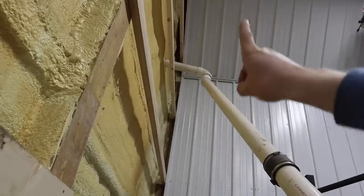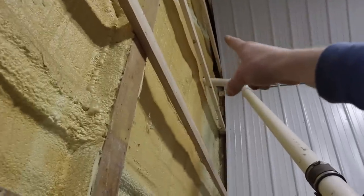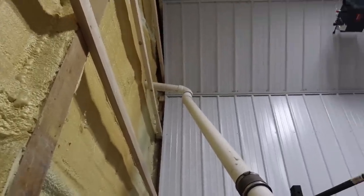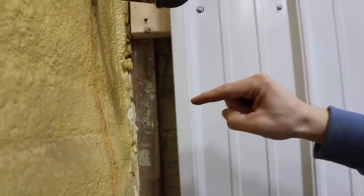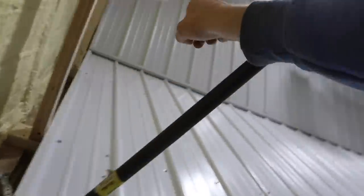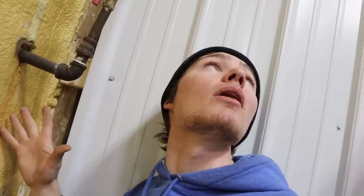This is a question for my HVAC slash gas guy: can I come inside the wall, 90 the PVC straight up, then 90 it over? We are 8 feet from the burner to the wall, so there's probably going to be about 10 feet. And for the gas line when it comes to the drip leg — do I need to have it right by the burner way up on the ceiling, or can I just put it right here where it comes into the building so it'll be sitting down here and everything will just go vertical up above it? I don't see how it could be any different if it's down here, but I don't know anything about this — can I put it down here?